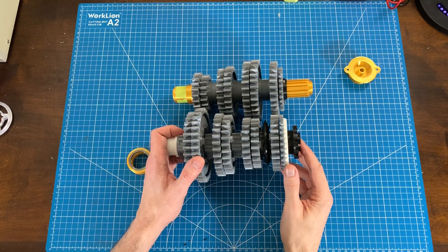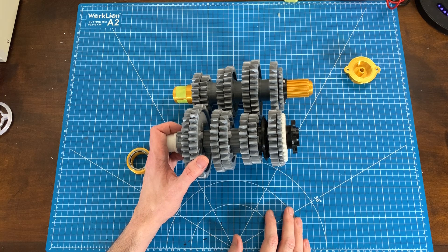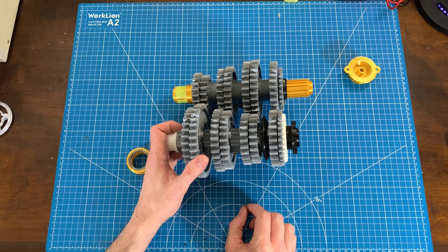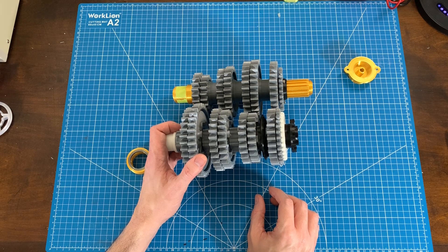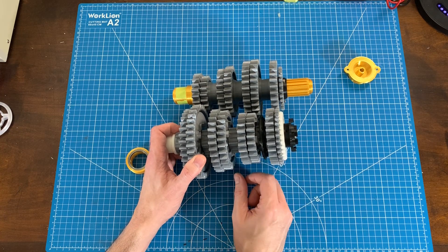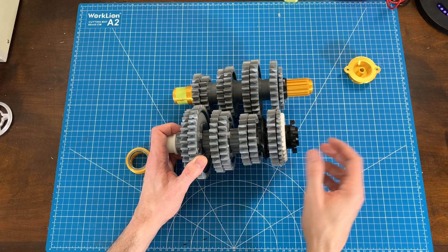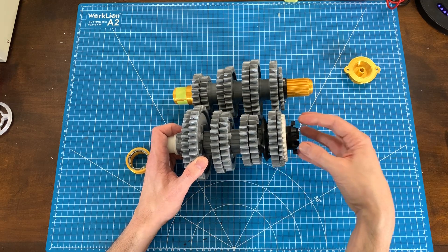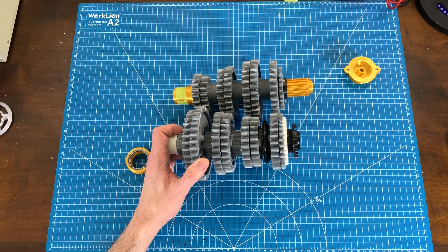Here we have our completed shafts. I've measured them to confirm they're both the same length, and I had to do a little bit of sanding on the lay shaft spacers to bring it in. This transmission has very tight tolerances, so the two shafts have to be within about a millimeter of each other in length. That's also important because this uses roller bearings, and roller bearings cannot take axial loads. The design will have a little bit of end play set up in the overall transmission so that we're not loading the roller bearings and causing them to overheat.